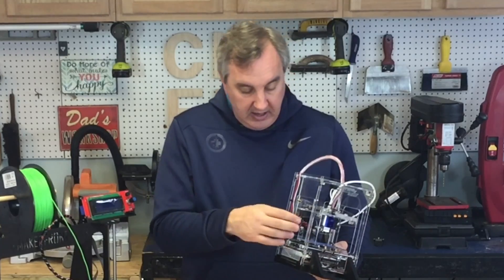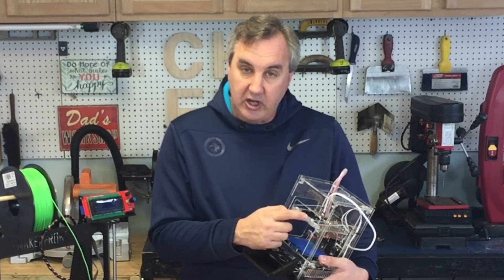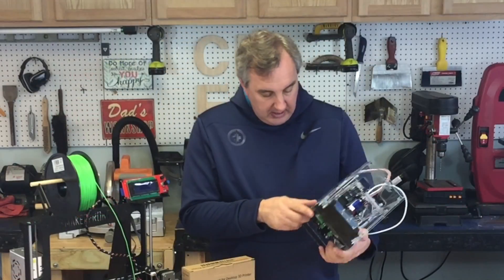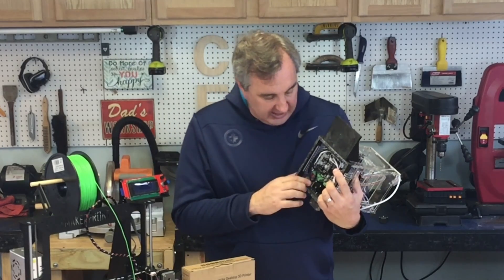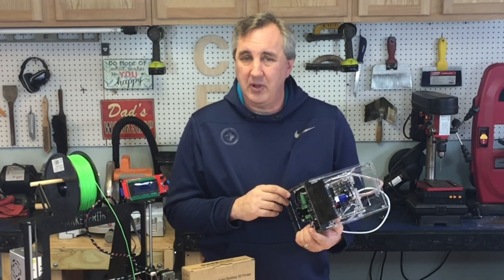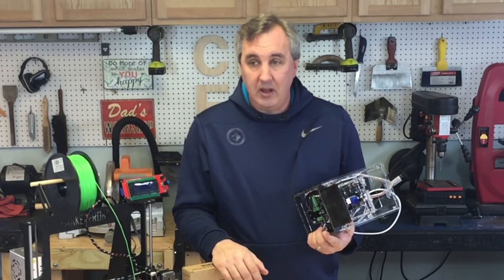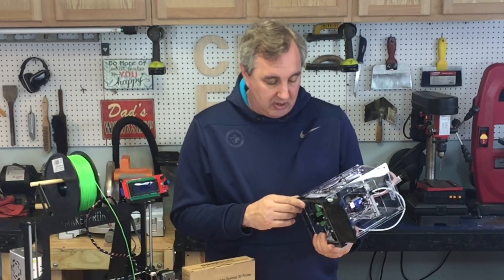The end rods — where the rods stop — used to be screwed in, now they snap in and hold better. The rods used to slide back and forth causing a tick-tick-tick sound while printing; these don't move. The front piece used to be stacked acrylic bolted together with a tie strap holding the rods — that's changed to an injection molded piece. The driver chips on the bottom now have heat sinks, which helps. My drivers on the original Fabricator Mini are all set to about 0.72 volts — some say that's a little high, most recommend 0.65 volts. I've run at 0.72 for hundreds of hours and they get warm but I've had no failures.